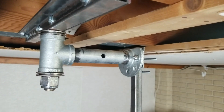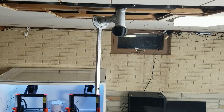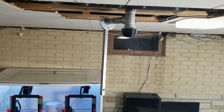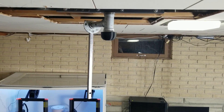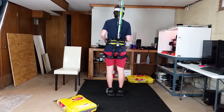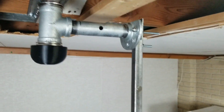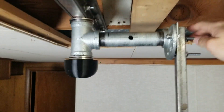I made more improvements to the swivel to make it stronger and better. I made a mount for the square tube that extends downward. The tube will extend down to the user and attach at the hips like in my previous support rig. The coupling for the square tube is rigid, holds the tube in the exact position I want, and is easy to take on and off.